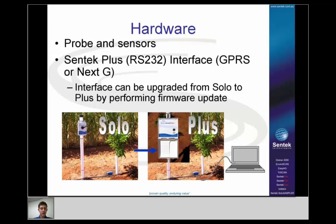Looking at hardware components first: you'll need a probe and sensors. The probe is the same as any other — same as SOLO, same as STL-12, the normal RT-6 probe. The main difference is the interface at the top, which speaks RS-232 through the top port to the DTU. That RS-232 interface could also be a SOLO interface that you do a firmware upgrade on.